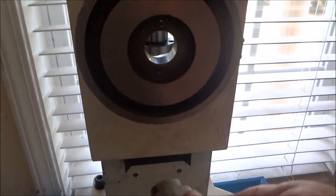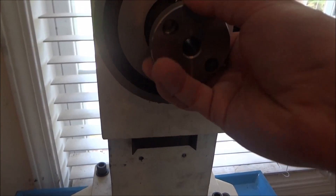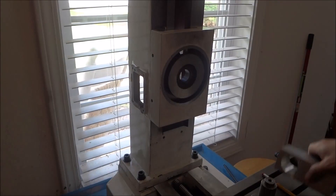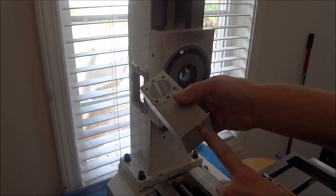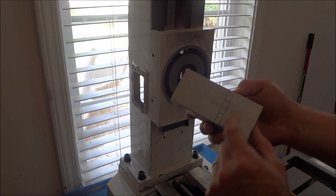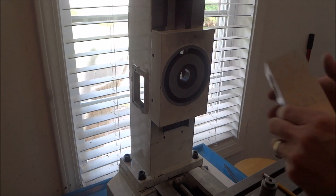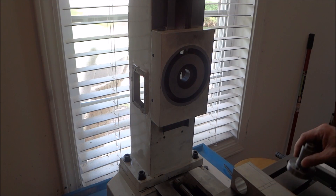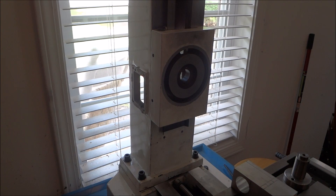I just took and measured to this barrel from here and got that distance. Then I subtracted the distance between here and here. Because when we made our ball nut mount, I left this really long — and that was so I could take these measurements. It's about an inch and a half long. I've actually redrawn it in Fusion 360, and we're going to take a look at that and then we'll machine it out.